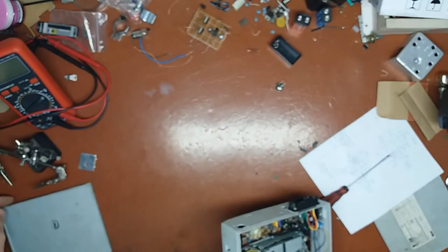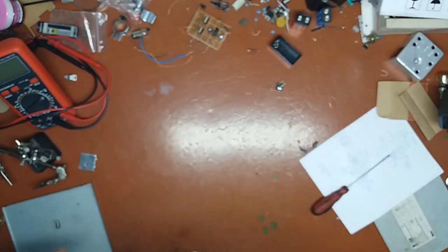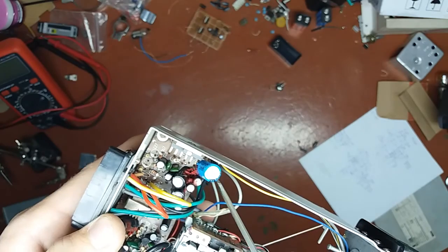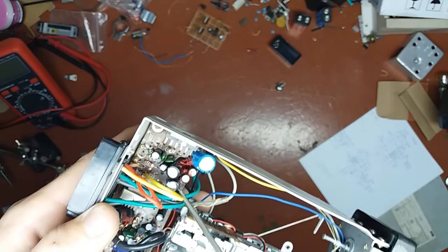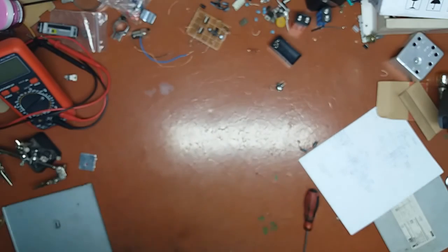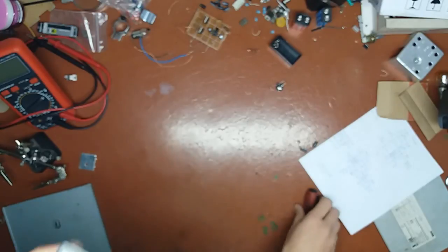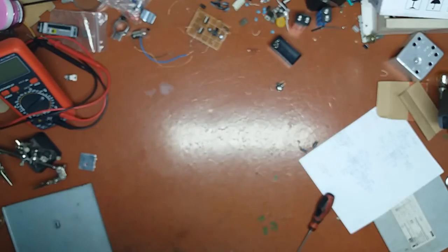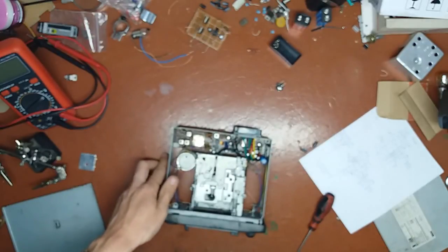Oh, this thing just keeps falling apart. Same kind of crap as in a previous video. So yeah, I'm gonna replace the chip, of course, because it's dead. Replace this capacitor, these two output caps, this one, and this one. And I also might replace a few small electrolytics nearby. I'm gonna check them with the ESR meter and see whether or not I need to replace them. So that's that so far. I'm gonna go and do what I babbled about for 4 minutes already.